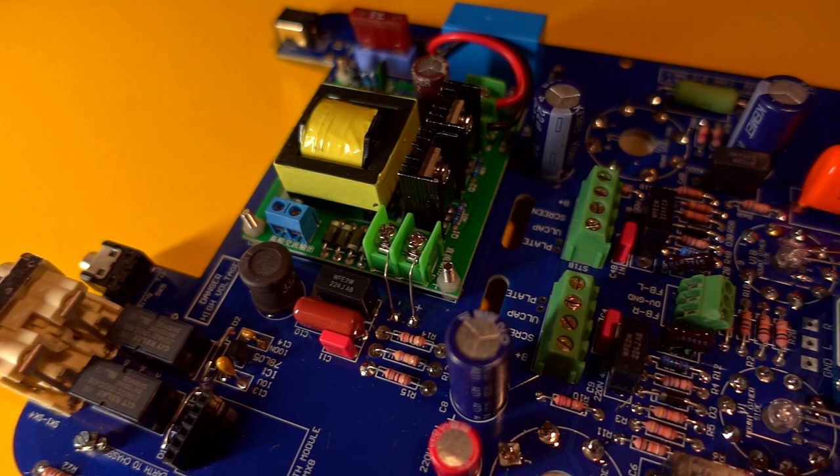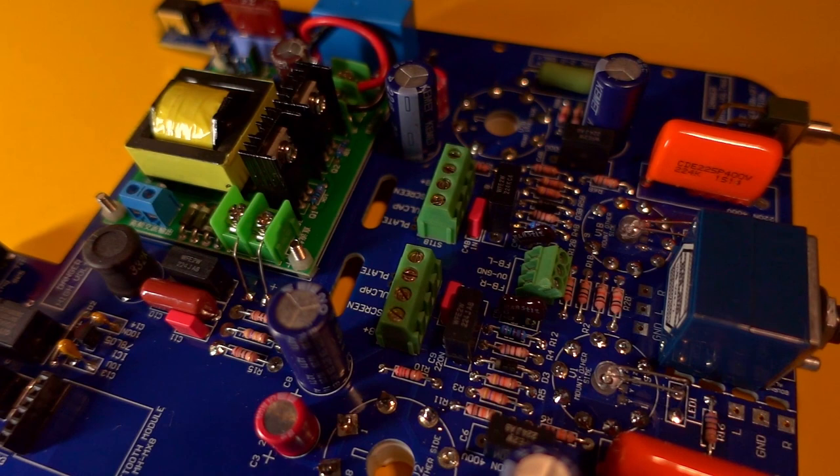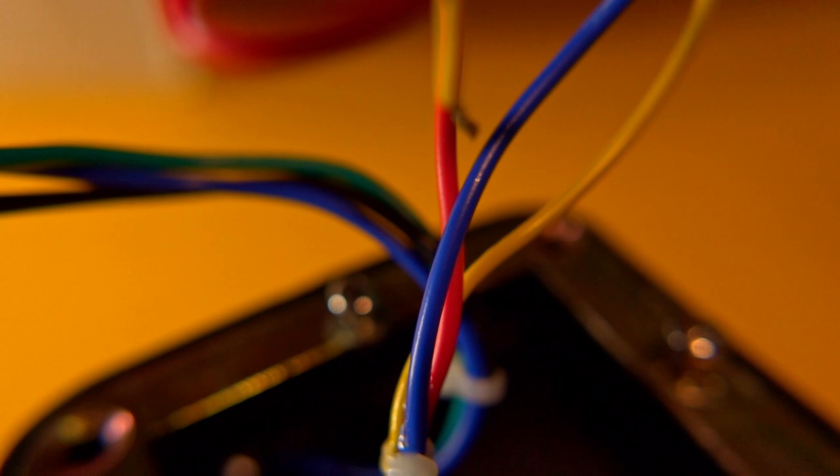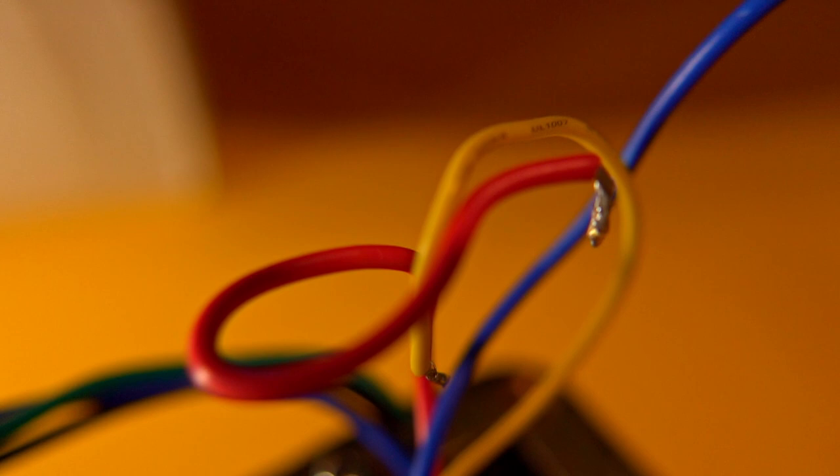What's involved: you get a pre-built circuit board that goes inside the chassis and gets screwed into place with spacers. You attach the two output transformers and screw those to the chassis. You connect up a few wires via simple screw terminals, following the colouring and instructions. Then you screw together the front plate and back plate, assemble the switches on the back, put the cover on underneath, and attach the feet. It's a job that could easily be done in a few hours, one evening. If you buy the solderless version, it's all been pre-tested, so you connect it up, switch it on, and start enjoying your tunes.